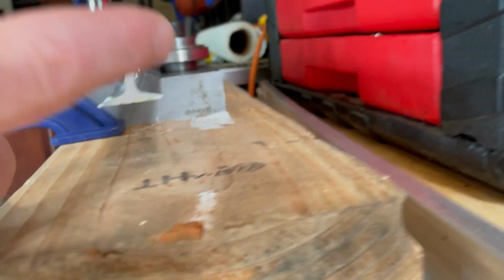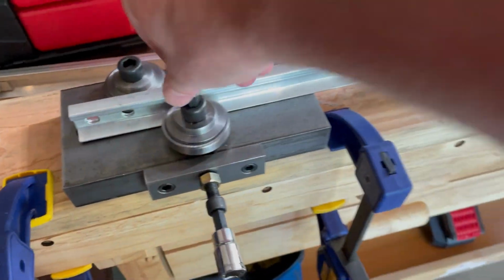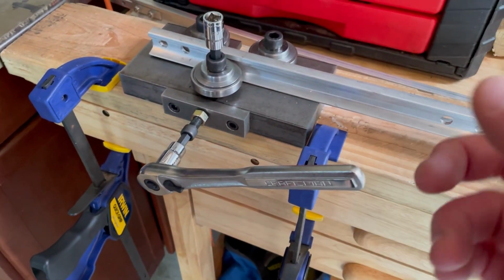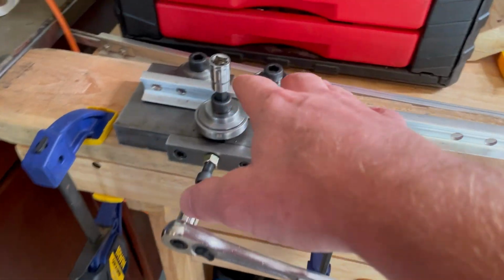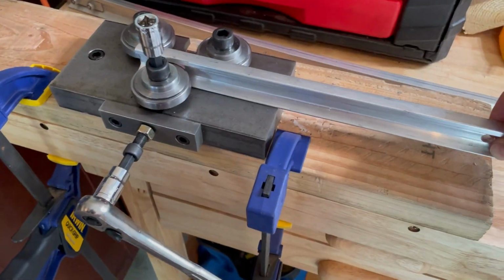Basically, just in the channel is where it hits. Cool. So anyway, get this hand tight, get this cranked into position, throw on the ratchet, and what you'll see me doing is only like an 1/8 of a turn. I'm not doing very much at a time, and ultimately, from our experience so far, you'll see it gradually start to bend as you're going back and forth.